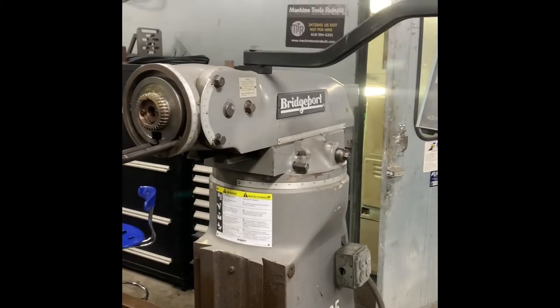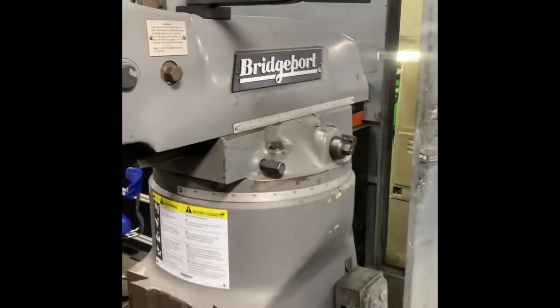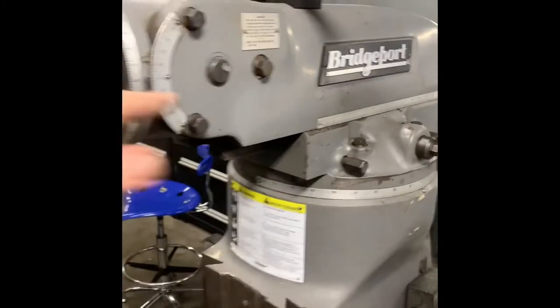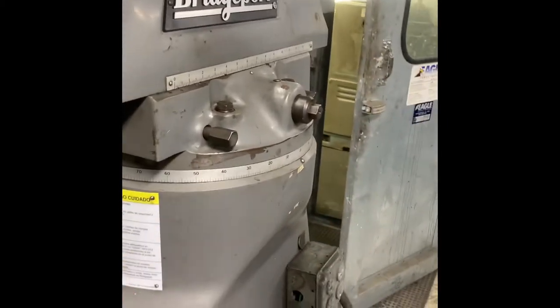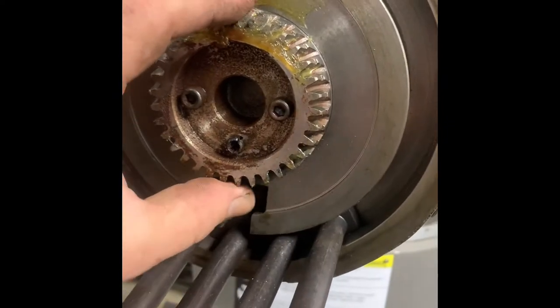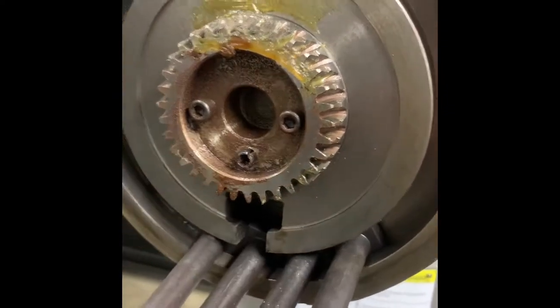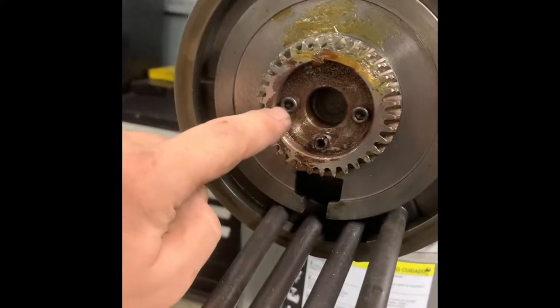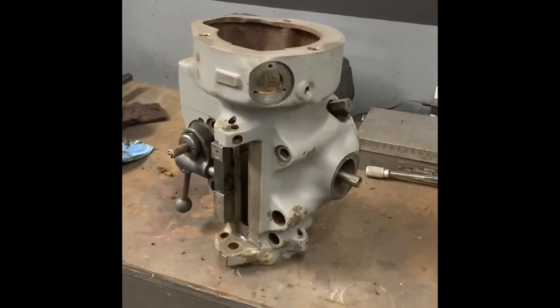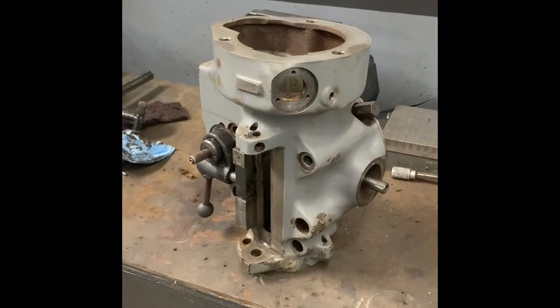Just a couple of quick notes on a service job. Starting from the top, I back all the nuts off and make sure everything is functional as far as the turret and ram extension. This gear here always gets loose — these two socket head cap screws get loose. If this gets loose enough, the gear used for tramming your head side to side will shear those screws off, and then you're really in a predicament because you can't tram your head. So this gets tightened up, new signage, everything gets lubricated, and then we're just about ready to reinstall the lower housing.